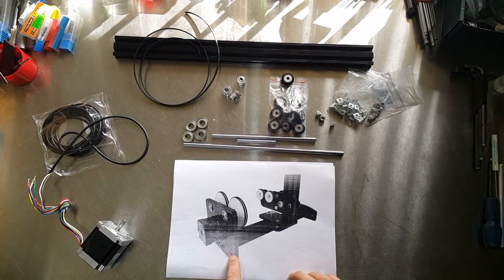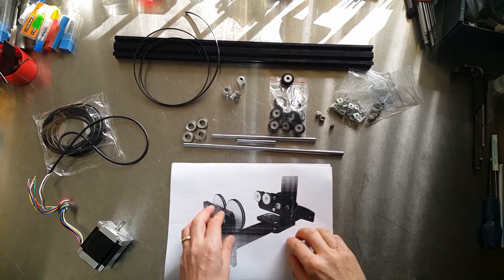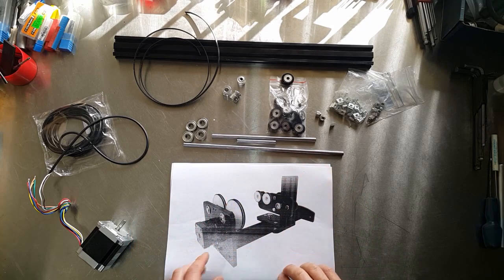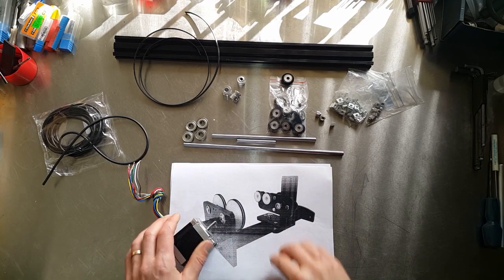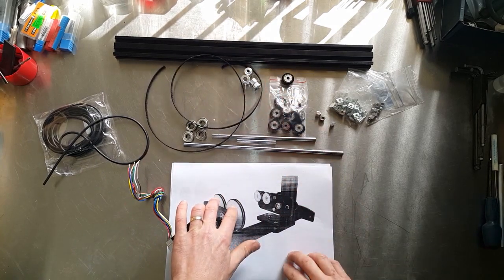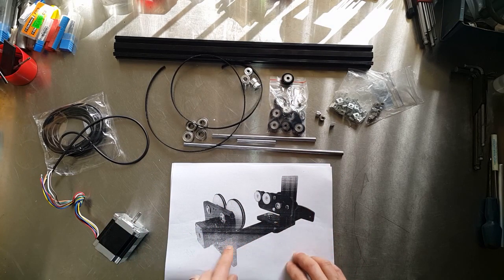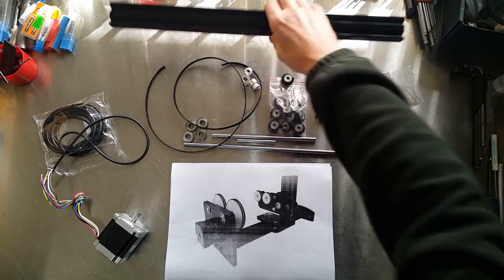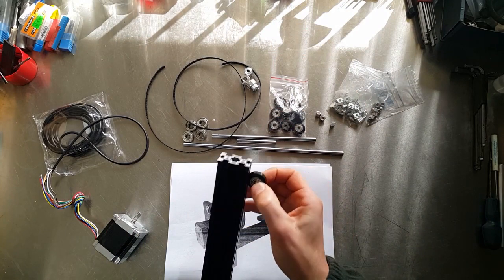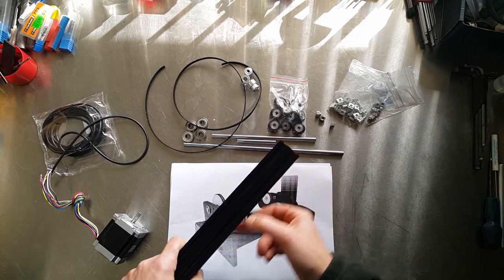Here's our drawing of the one we're going to copy. What we've got is a fixed end and a movable end. We need to make it movable so we can engrave onto a bottle or a small glass. The fixed end will have a stepper motor and we'll go through a series of gears and drive belt to drive the two larger wheels. At the other end, these two wheels will just be free rolling. On the beam itself, we've got a piece of 40-20 V-slot profile with V-slot wheels to match, allowing us to move the end up and down as well as in and out.